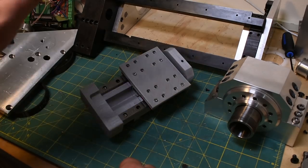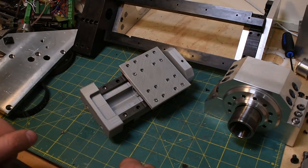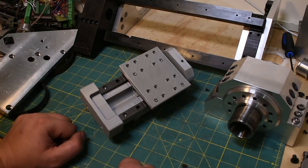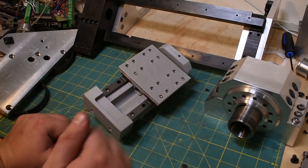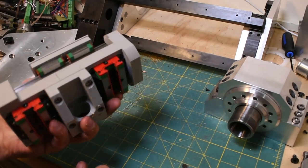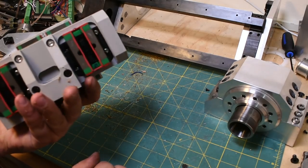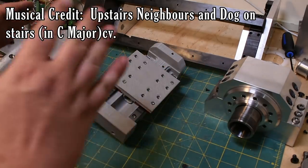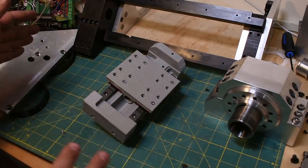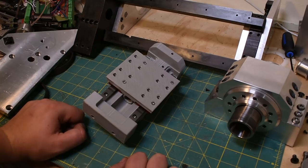So I've basically got a spindle design I'm relatively happy with. I've got some oil passage routing to do and some wiring to do, but other than that, I think it'll be okay. And the cross-slide design is coming along. Not quite finished. I've still got limit switches to put in, and oiling, wiring, that kind of stuff. But I think from there I'll be able to assemble everything in 3D space, and then I can make a base that fits everything rather than making everything fit the base. It seems obvious now that I say it out loud, but it certainly wasn't obvious when I first started.